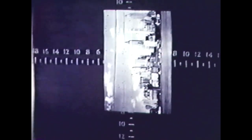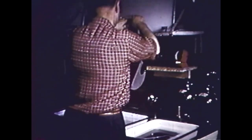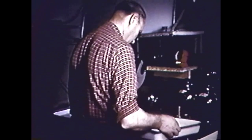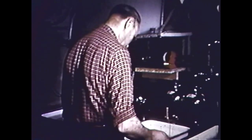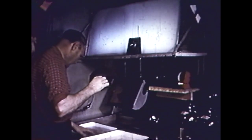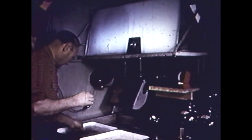We have now returned to the outside of the dark room. These brilliant lights are arc lamps. When the camera shutter is open, the exposure is made. The copy is photographed through the lens and half-tone screen. The negative's latent image is developed under safe light conditions, which cannot affect the image development. Since the exposure was made through a screen, it follows that the developed negative will also show a photographic impression of the screen. These lines form the characteristic dot values that will subsequently represent the printing portion of the plate. Then the film is placed in a stop bath to temporarily halt developing, and the half-toned dots are closely inspected with a practiced eye to make certain that they are neither over- or underdeveloped.